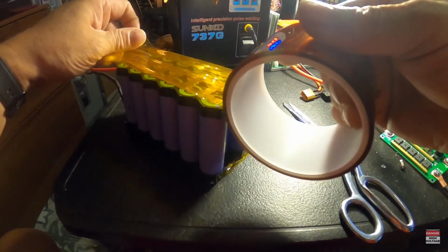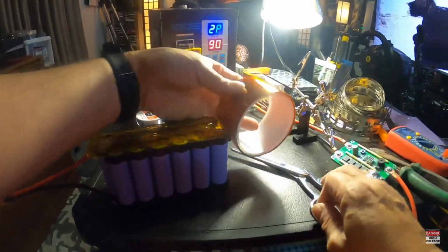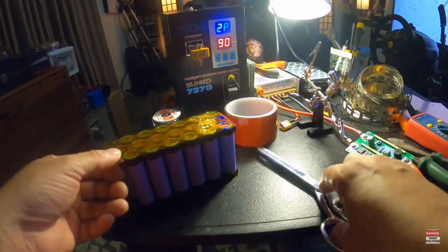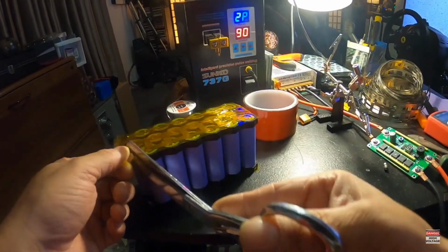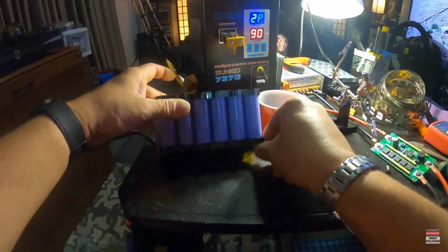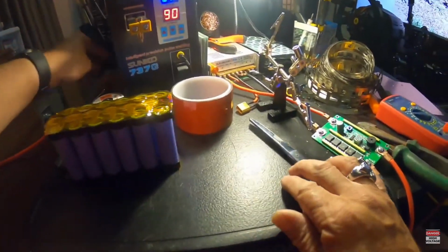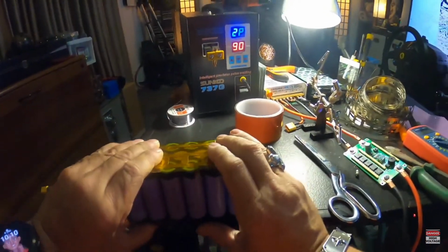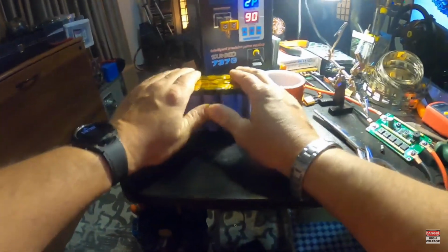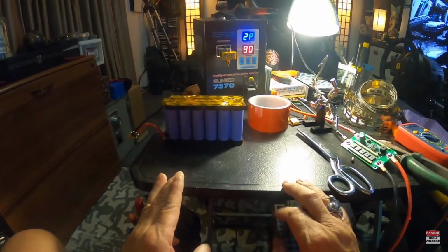And that's a hell of a lot of magnetic field trying to overcome when you've got all them RPMs under that much current draw. The magnetic field being created, that back EMF, is so strong, that's what is keeping me from cruising over that triple digit mark. But once I can keep that voltage up above 71 volts, because the low voltage cutoff on that ASI is 71 volts. It's set at 71 volts.